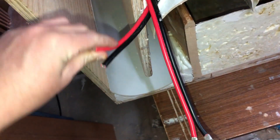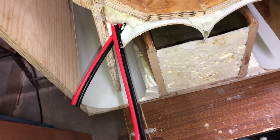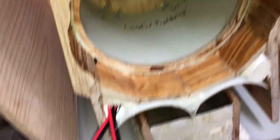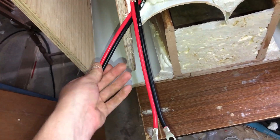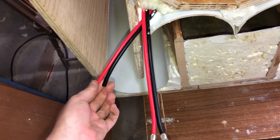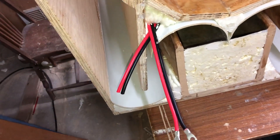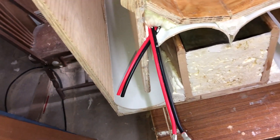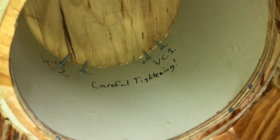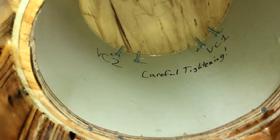Each one's capable of handling about 50 amps. So if I ever put 6,000 watts into the sub in here I should be right. And these should be able to handle up to 8,000 watts into a 4 ohm sub, or 16,000 watts for an 8 ohm sub. But it's very unlikely I'm going to get enough volts ever to put 16,000 watts into an 8 ohm sub. Nor is this chamber going to be able to dissipate 16,000 watts worth of heat, or 8,000 watts if it's 50% efficient.